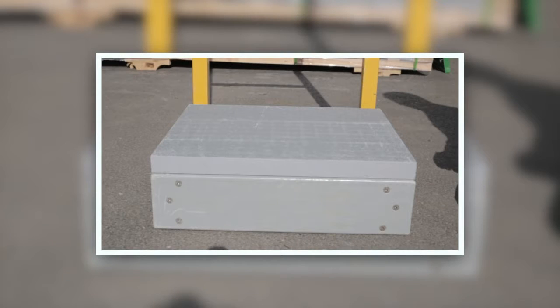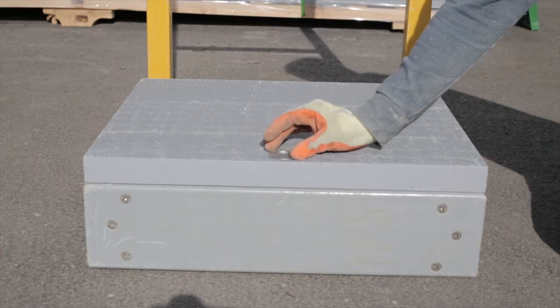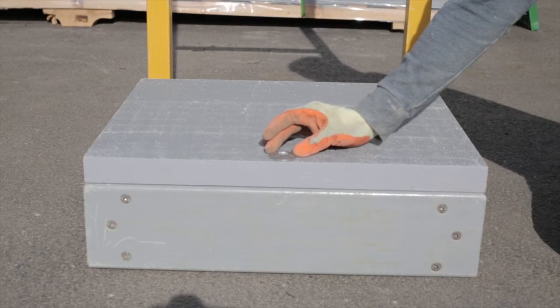Step 1. Cutting. Cut the panel to size using an untoothed blade. The upper surface of the grating is impregnated with quartz and may blunt an unsuitable blade or grab the material. Cut the panel face down along the nearest moulded rib to ensure you retain the structural integrity, strength of the panel.